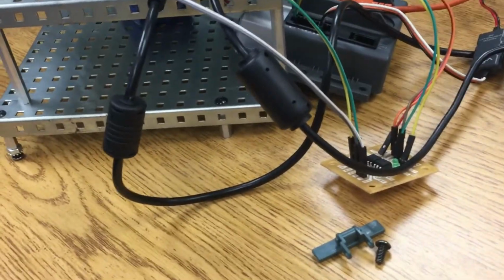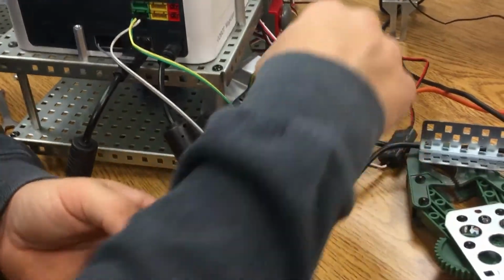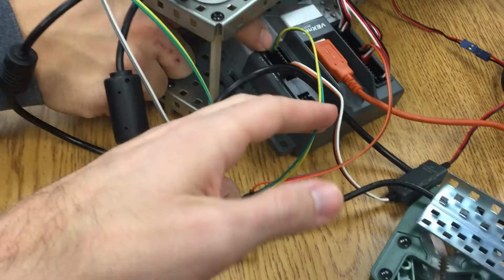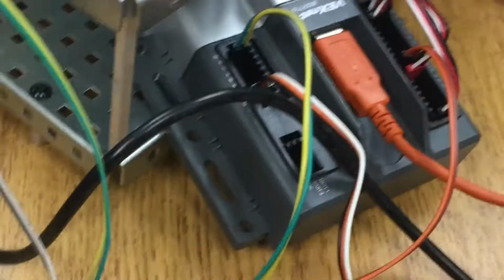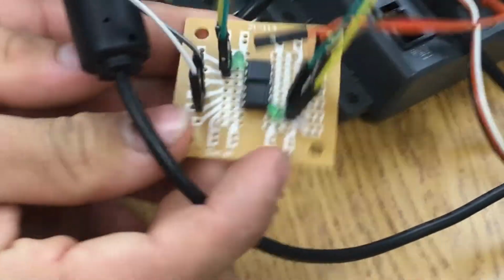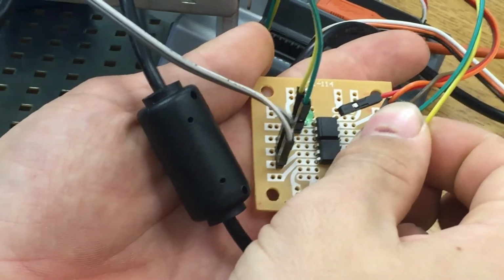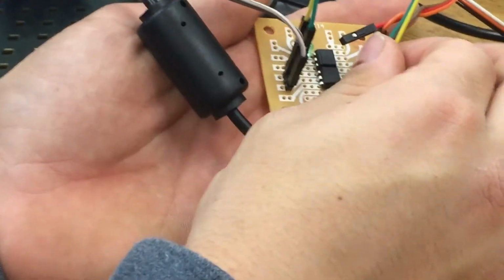Okay, so let's look at these pins to see how you wired that up too, because for me, that's totally confusing. You got a whole bunch of wires in here. Does it matter what color these wires are? No, the wires are just wires. So we got it coming out of port 10 on your VEX motor port. These are plugged into the motor port here, 9 and 10. Pin 9, side by side. Then they come over here, and whatever side has the LED, there are 2 pins. They just plug in. Nothing crazy. They are directional, so if it doesn't work one way, switch it. They'll work the other way.